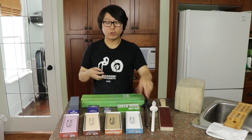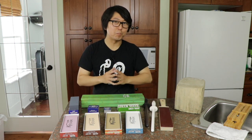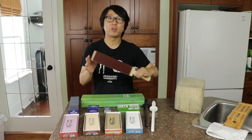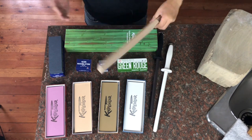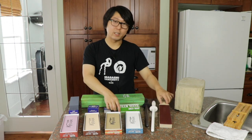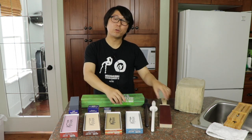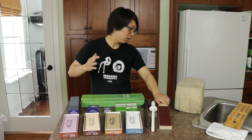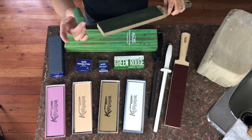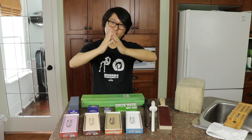After finishing up your knife with finishing stones like 4,000 or 8,000, you want to polish your edge and make sure there is no burr left on the blade. That's when you want to use the leather strop. We usually start from the suede side and finish on the fine leather side. What's really great with the leather strop is this chromium oxide bar — it's like a clay that goes on top of the suede side. It works fantastically to remove the fine burr at the end so that the edge stays centered, not bending back and forth.